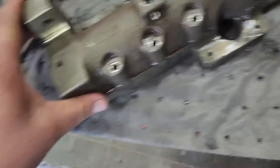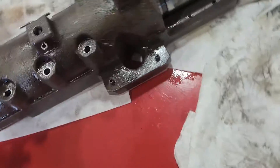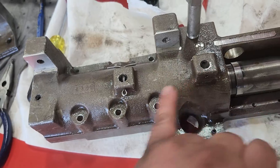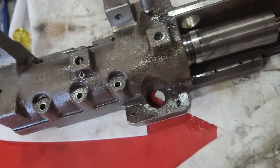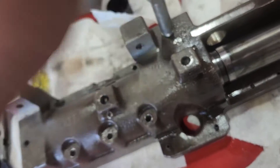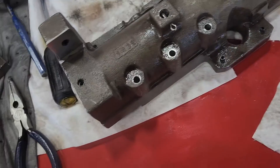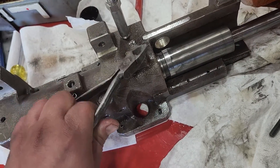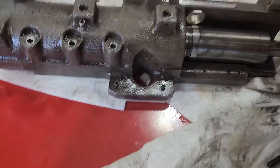You're going to go to the part with the fork. You're going to have two cotter keys that are facing you after you get these halves apart. It's very easy to get these apart — don't be afraid of it. You're going to pop this open and look down there. This right here is a pin that sits down in there — it's threaded. So you take out the bolts that hold it in half and thread them down in there. Then grab a pair of pliers or side cutters and just work that bolt out. It'll come out fairly easy. You're going to use this as a slide hammer — these are all instructions given to me by LeBlond.